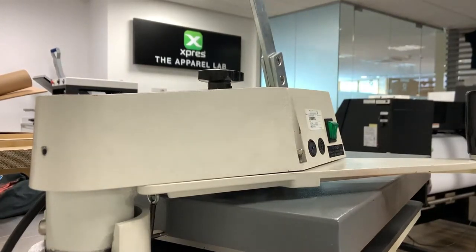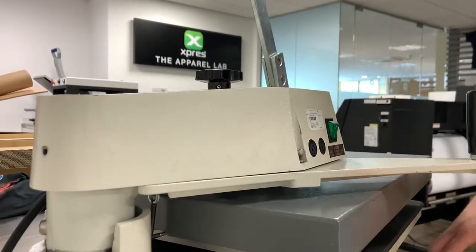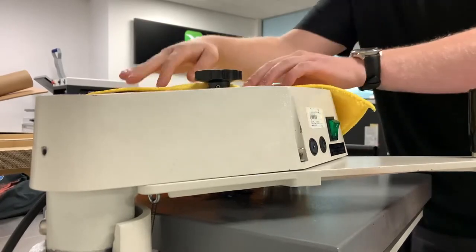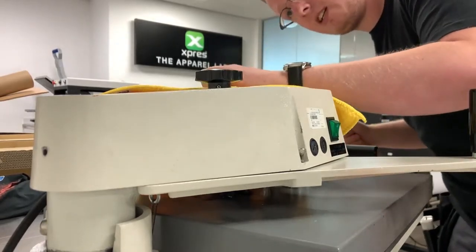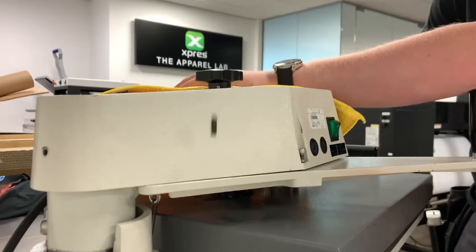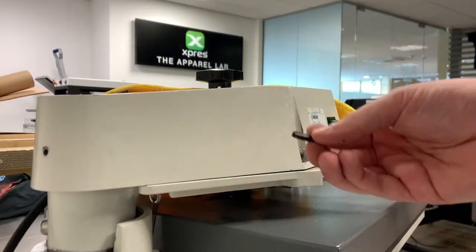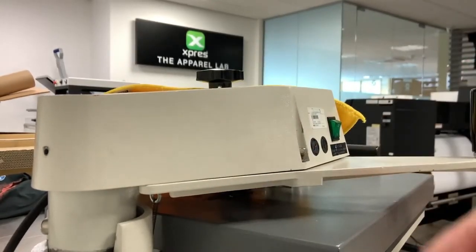The really important thing when trying to get this split pin out — you can see this silver split pin there — is to try and hit it from both sides. So first we're going to try from this side: put the cloth over, clamp the handle down so the machine doesn't rotate or swing, then just try and pop the split pin out this way. If the pin isn't moving when you hit it with the punch and hammer, that normally means you're going the wrong way.